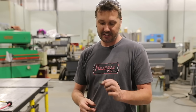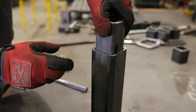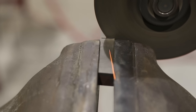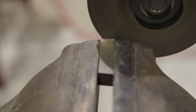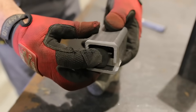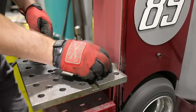The high speed steel needs to measure the exact width of the male tube that's going inside the female. When you cut the high speed steel to length, you can't take it to the bandsaw — you're going to have to use a skinny wheel or some sort of abrasive cut-off. Just make it the exact length and you can grind it really, really close with either a belt grinder or a flap disc.